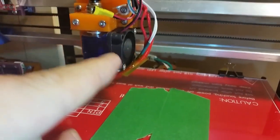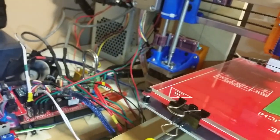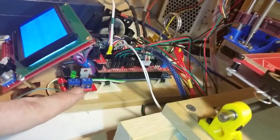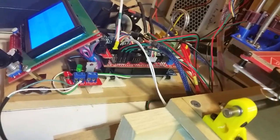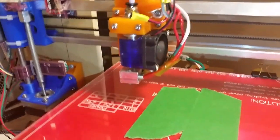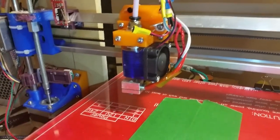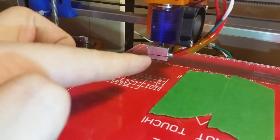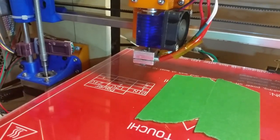The other big thing — I took this fan off of the FET. That fan on the side will now spin if this is powered up, just like this fan. This FET is not doing anything now. The E3D guys on their site say these fans should just be running full power — you shouldn't have them switching on and off — to make sure that you get enough cooling. And considering there was a heat soak coming up into that heat break, that made a lot of sense to me.